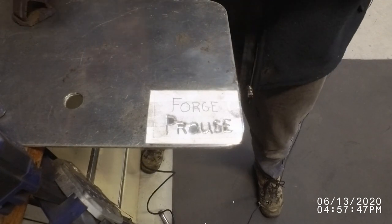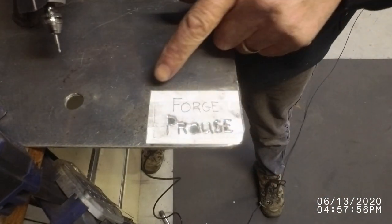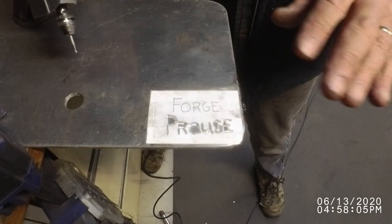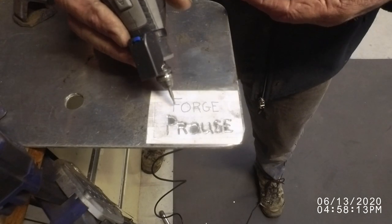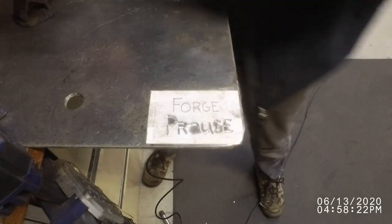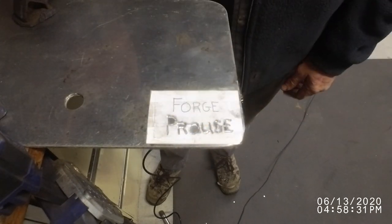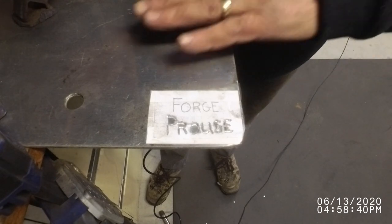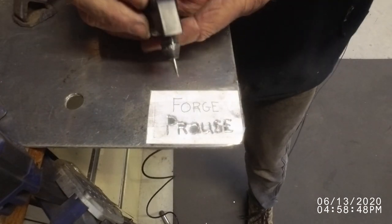Here I am attempting to do a bit of engraving. I've got the Dremel out with the smallest little burr that I have. I've sticky-taped a piece of paper to this bit of aluminium in the corner, cleaned it up a little bit first, sticky-taped the aluminium to it with the engraving writing that I want on it, and I'm attempting to etch in the letters as I go around. Then I'll pull the paper off, work those letters to a decent depth, attempt to paint it, and then give it a nice light brush over with a very worn-out flap disc to brush the surface back up, hopefully leaving the dark etching in place.